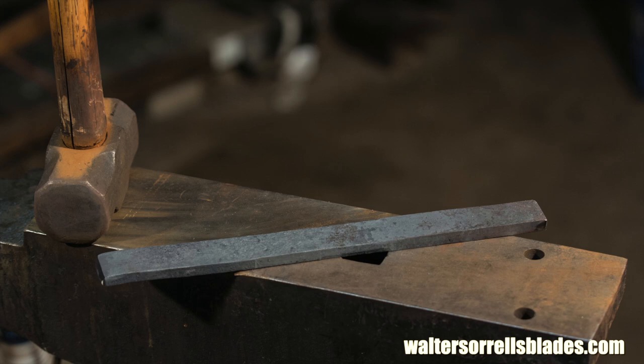If you want to try your hand at heat treating, go with O1 steel or a simple carbon steel like 1084, 1075, or 1095. Each of these is a little different with their own nuances, but they can all be used to make high quality knives with relatively simple equipment. Likewise, there are tried-and-true stainless steels like 440C that have been around a long time and heat treaters really know how to heat treat well. Start with those first — they're cheaper. Make your mistakes on those, then go to the super steels later.